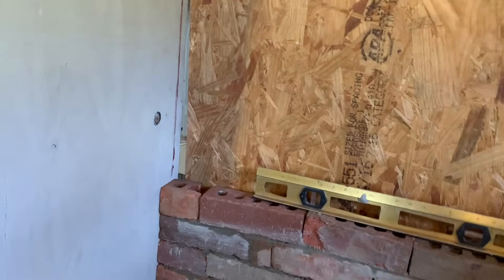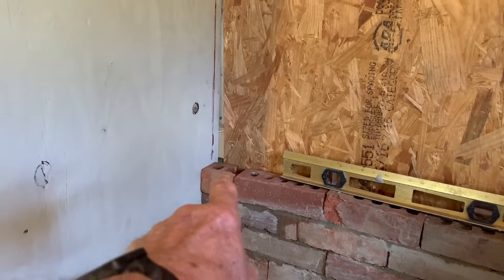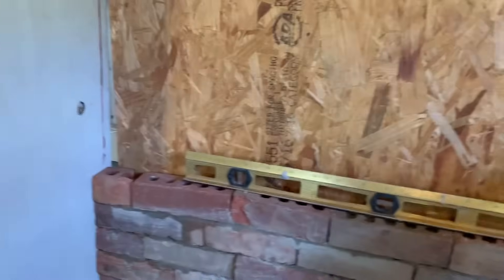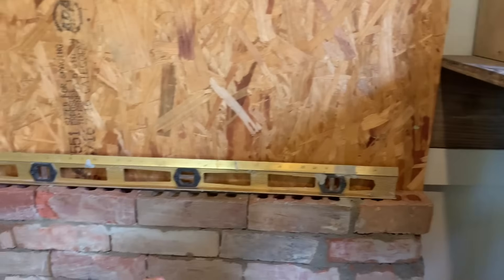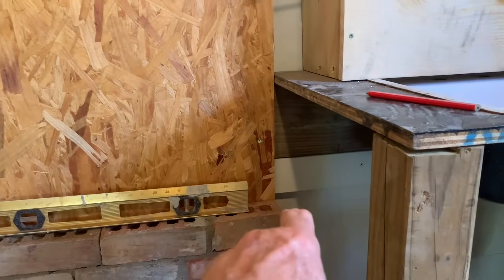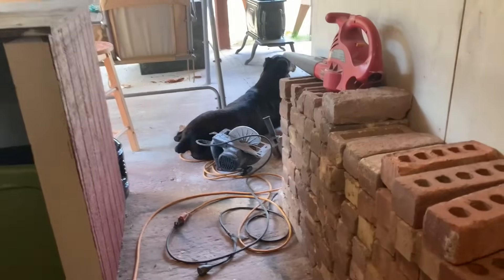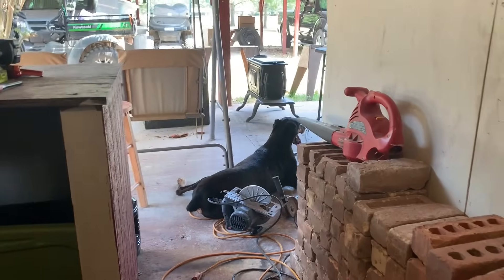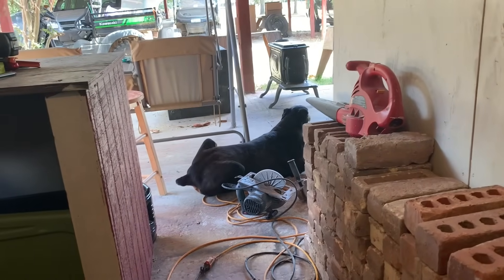What I'm having to do — I'm having to cut a brick or two to make it so the little lines are not all together on each row. I'm putting my brick up starting a whole one over here and coming across to here. At some point I'll put a little short piece in the middle so I can try to have a whole one on this end. I've tried chipping them and I can't chip them without busting them up. So I've got a skill saw with a metal cutting blade, and a grinder with a metal cutting blade — both make smooth indentations. Then I try to chip away from that point. I'll show you the next time I cut one how I'm doing it.